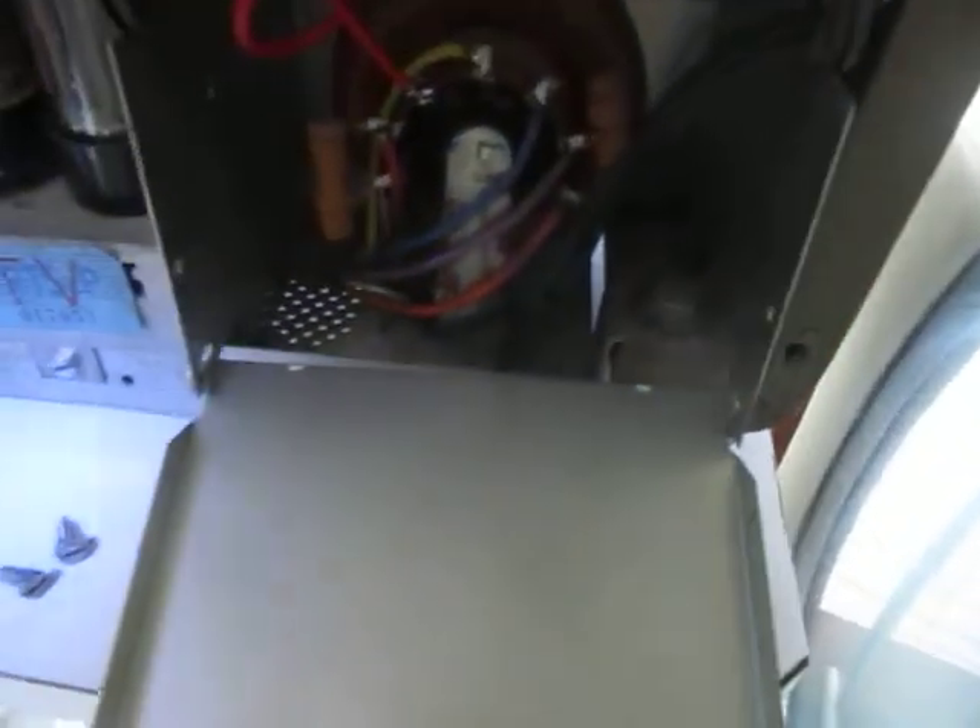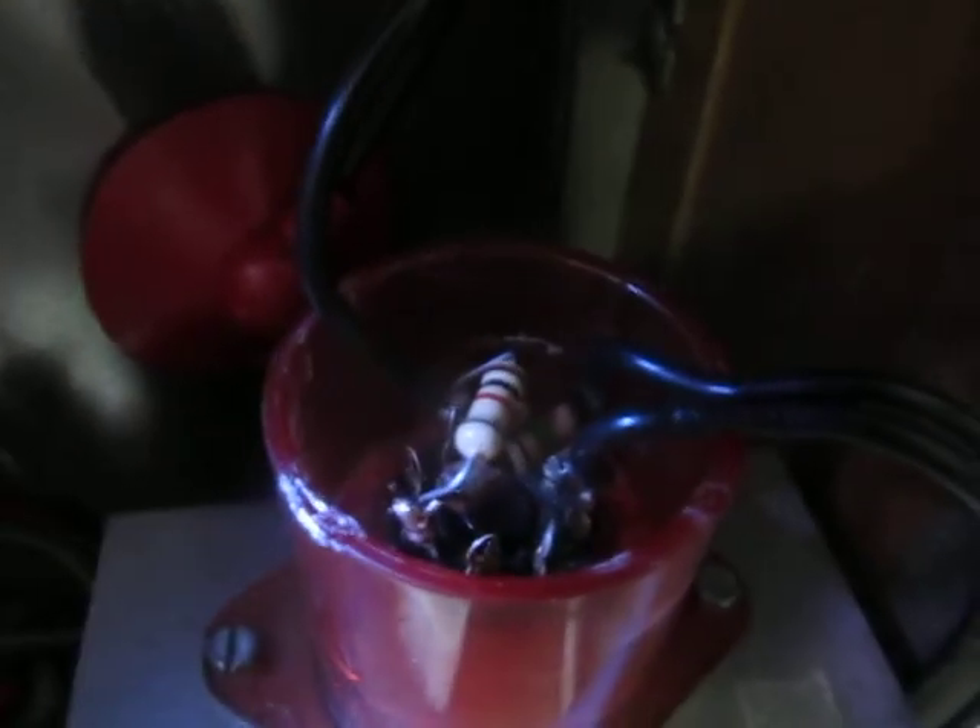Probing around I found my main issue. There are two resistors in here, both were carbon — one's a 1.5 ohm or 15 ohm, and the other's a 1k ohm. The 1k ohm resistor had gone open circuit, and because it's on the line between the 1B3GT and the CRT anode, that meant that very little EHT was getting over.